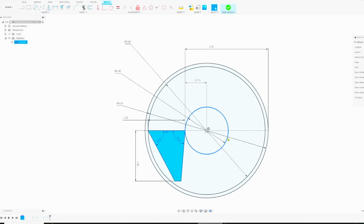And then I just highlighted here in blue, drew in a shape for a tool that kind of fits in there. The cutting edge needs to be on center line, and then you add some clearance angles to the side so it doesn't hit the side wall back here. You also need some clearance to the pin just to make it cut free. In my case, I chose 5 degrees. That's an arbitrary number. You could also go for 3 or 9 or 7 or something.